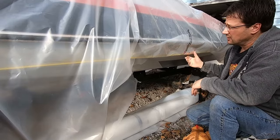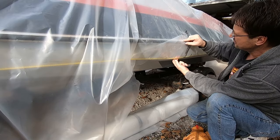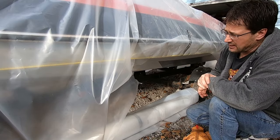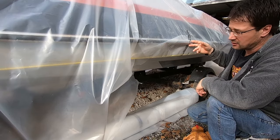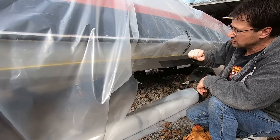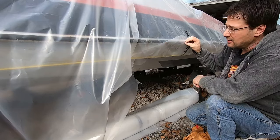Now, if you notice, I've got quite a bit of overlap here, and I've brought the back piece up over the rub rail. The reason for that is, when I weld along here, this is a good spot for me to weld it. I can really push the two pieces together when they're warm and get a good bond there,